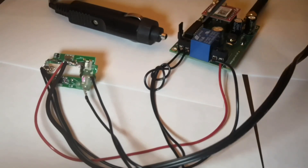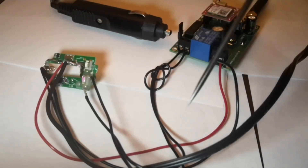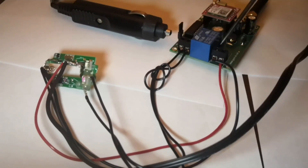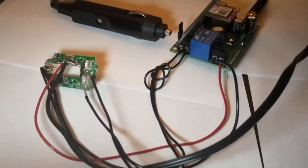We've got the GSM module and the remote module. I've soldered onto the battery terminals a supply that I can plug into a 12-volt socket in the van. I've then taken a loop off of those two terminals and put it into the supply of the GSM controller — that's polarity independent. Both the remote batteries and the GSM supply are 12-volt, as the little A27 batteries are 12-volt. The wires I took off the remote control go into the GSM relay terminals. And if you had the rotary, the wires you tagged into the back of the rotary controller go in there. So now we're all good to go, and what we need to do is just program up that GSM controller.